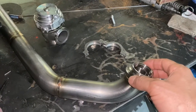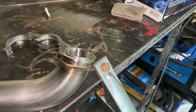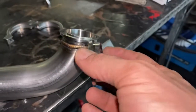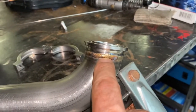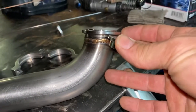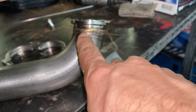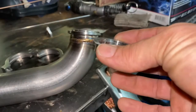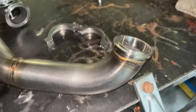I'm going to go ahead and get everything ready. I'm actually going to cut this flange off at the weld. I don't necessarily want to make this pipe shorter, so I might be able to get away with cutting it before the weld so I have new real estate — a new area to weld on. Then I'll put the new one on, tack it, and go ahead and weld it.